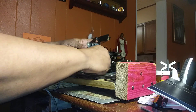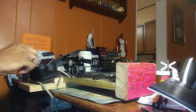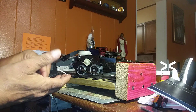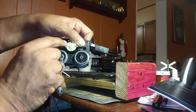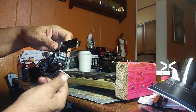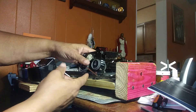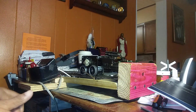These drive rods are just creating a problem for us. Sometimes you can run them okay with them on there and sometimes you can't. We're going to take it and go ahead and put it back in its shell. You can see here where I soldered the diode in. I usually don't come that close up to the diode — there's too much heat to the diode. We'll put it in its shell and then put it back on the track and try it back together.